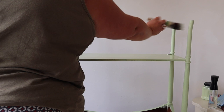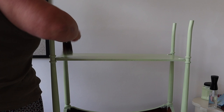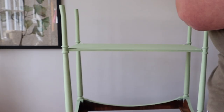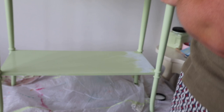For a smooth finish I'm also using a synthetic brush and my continuous mister bottle with just normal tap water, just to make the paint go really smooth and give that nice smooth finish. All of the products I will link in the description below just in case you miss anything. When everything had had two coats on the underneath, I then tipped it over and painted all the other surfaces that were visible, like the shelf and the very top of the piece.